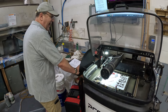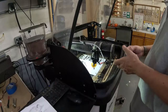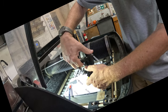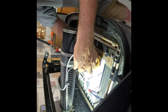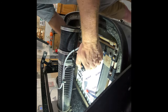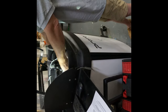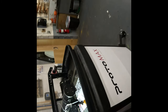The next step is to set the Z height of the nozzle. Flip up the rubber ball cover so you have better access to it. Hold onto the Z travel as you're lowering it, because it can slam down and damage the nozzle. Set it so that it's just resting or touching. Push in on the bracket because it will move a lot when you crank down. Tighten it, and then the Z gauge should be slightly loose.